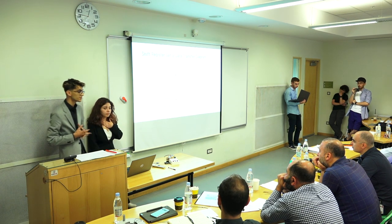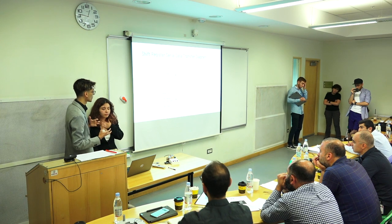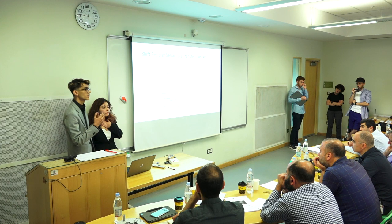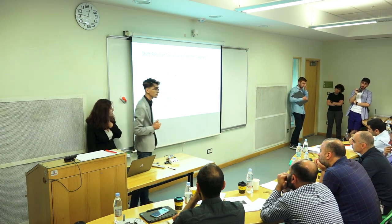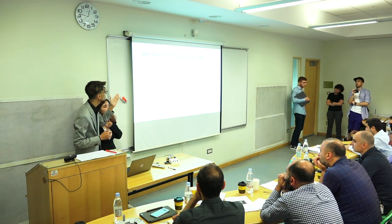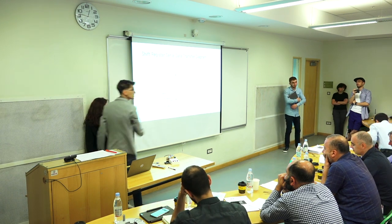This is the shift register serial data transfer diagram. This is how most of the logic works. We have our Braille code. In this case, a 1 means that the pin is being activated, so it's either pushing upwards or pulling downwards, and 0 means that it just doesn't do anything. Then we also input into the shift register a high bit value, in this case a 1. If the bit of the first pin is equal to the data pin input, so if in this case both of them are 1, we will enable the shift register, hence the current will start flowing.